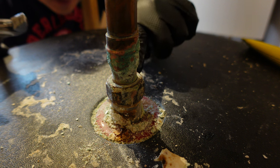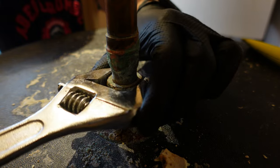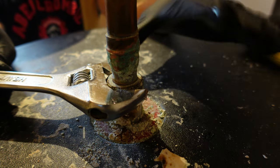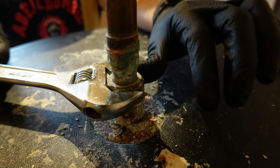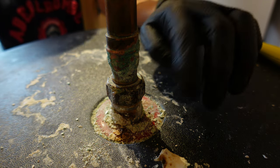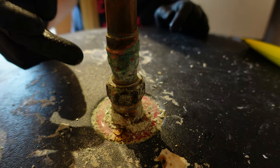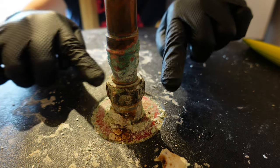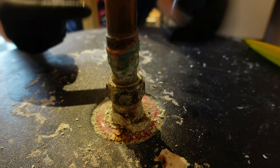That's a good sign - I can see silicone being squirted out from the copper pipe on top of the nut, where the water usually spills out. I'm not going to over-tighten it - just tight and then another quarter turn - so the silicone should be squeezing out from all the gaps on top. I can see it spilling out, so I'm just going to do a little cleanup.